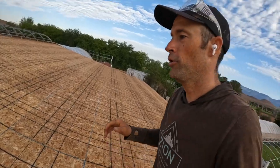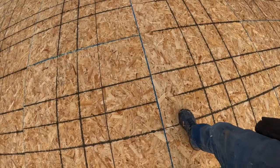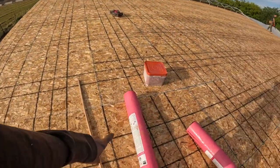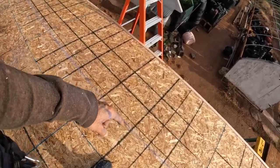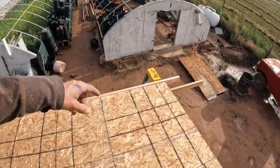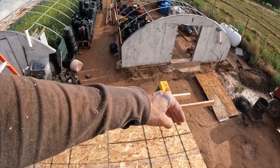Steady, boy. This roof is very, let's say, squishy, and we're going to be a little more careful today on where we stand. That way we keep it safe. We are ready to start laying out our pink synthetic underlayment. We've got our first chalk line ready to go, so we've got something to follow along. And then we're going to go over 6 inches and over 6 inches. That way we can tack it down and give a little bit more waterproofing on those edges.